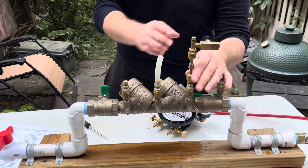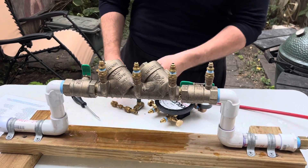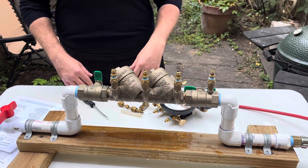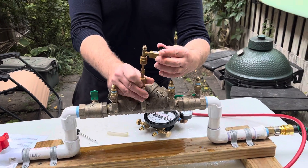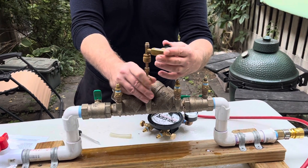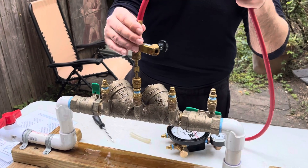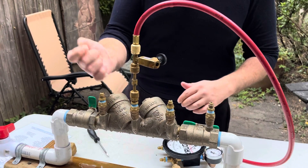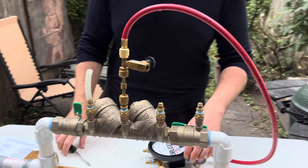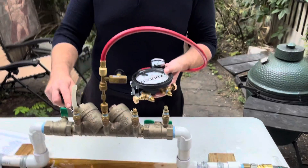If you move your equipment over you're probably okay, but if you're doing a very specific exam where they want you to follow exactly, you might want to remove everything and put it all back. Attach your bleed-off tee to test cock three. Attach your high hose to the bleed-off tee. Attach the clear hose to test cock four.